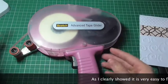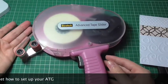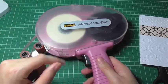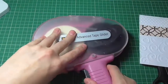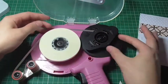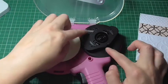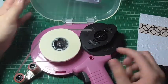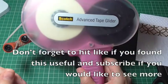I hope you've found this helpful to refill your ATG gun or to set it up for the first time. If you find that when you're using the gun you get a squeaking sound when you press the button and run it, just open it up and make sure everything's lined up nicely — maybe wiggle this section, it may have come unaligned, or down here it's not wrapping as tightly as it used to. If you just adjust that slightly, the squeaking should go away. Thank you for watching.